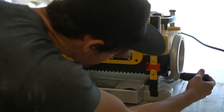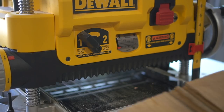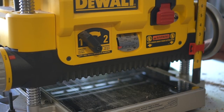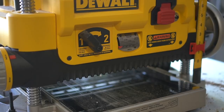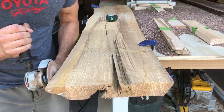You just need to make sure you're gauging the right height and not taking off too much at one pass. You want it nice and even — one of the first things is making sure the gauge is correct. As you can see, that indicator shows I'm taking off a bit too much. If you raise it up a bit the red arrow goes down, which is what I wanted. There are two finish settings on this Dewalt planer: setting one gives a smoother finish with twice the cuts per inch, while setting two cuts off more material faster but with a less smooth finish.